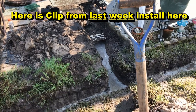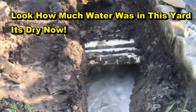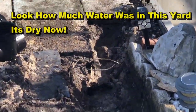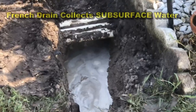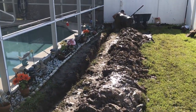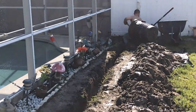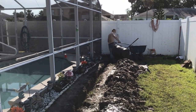We have our trench installed and you can see how much groundwater there is here — it's just unreal. The hardest part is those pool return lines, which forced us to take our line a little deeper to get underneath, and that forces the entire trench line to go deeper so it can run downhill to the sump basin. On the other side of the fence is our discharge — inch and a half PVC — and we've got a guy out there getting ready to do that. Very straightforward project — something you homeowners could do and save yourself a quick thousand bucks. This is Chuck with Apple Drains reminding you: if you believe you can do something, I guarantee you can do it. Have a great day!